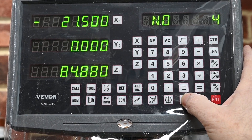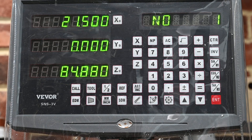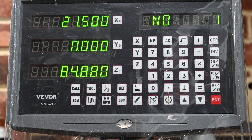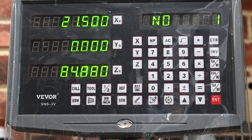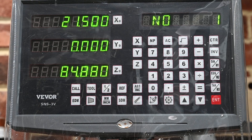You can go back in any order. What I do is go around and do all of my holes — it's set up to optimize the table movement so you're not going diagonals; it keeps you on the same X or Y axis if there's another hole on that axis. Then when I want to tap the holes for the thread, I just go around again with a tap follower in the quill to put pressure on the tap, using this to position the quill for the tapping as well.